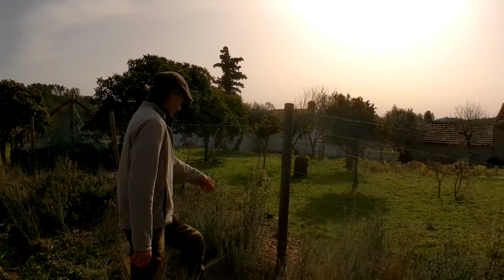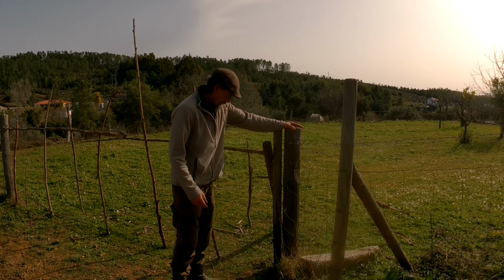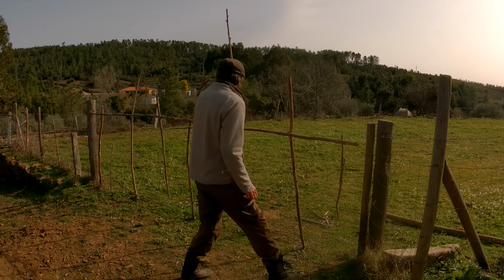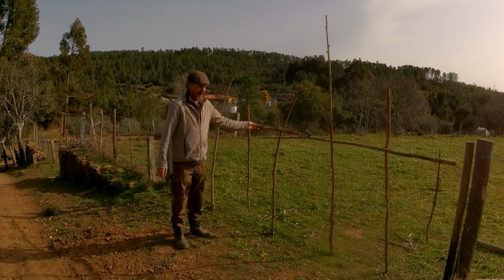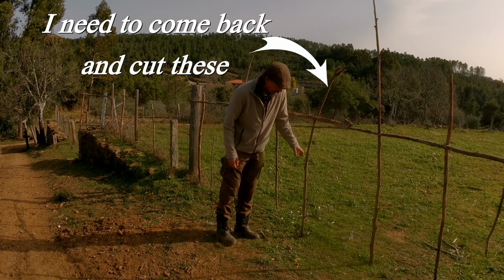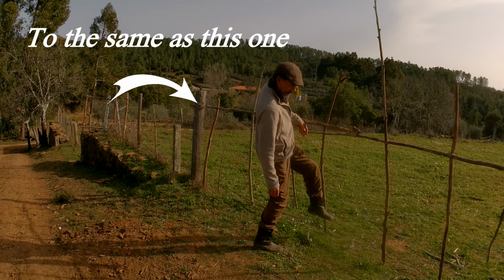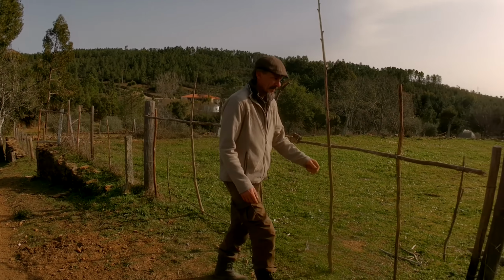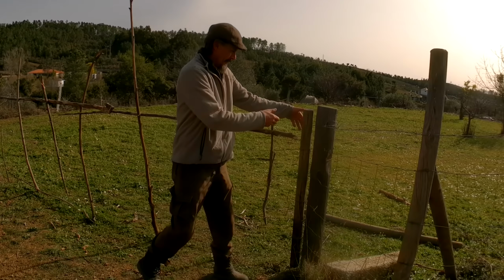But this isn't the piece of fencing the goats like to test, it's the one at the back because it's lower. Yeah, this is a little bit taller here. So you see, when I put this gateway in, I've utilised telegraph poles as corner posts. And this extra bit of height, again, it's sort of a Portuguese thing. When you make these gates just out of fencing, having vertical strainers in it really helps when they push against it, and they push a couple of times and then they leave it. But again, that's got pretty much the same mechanism as we've got on the other side.